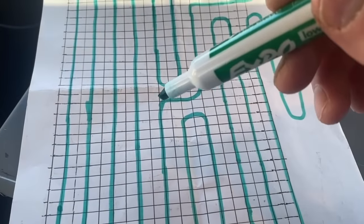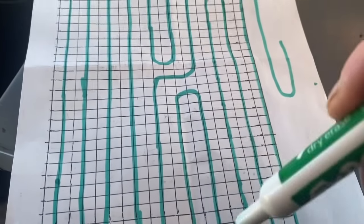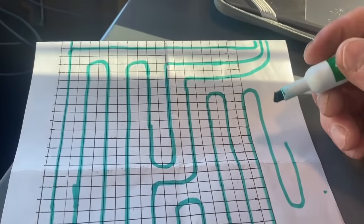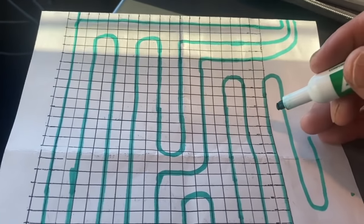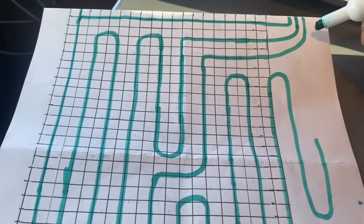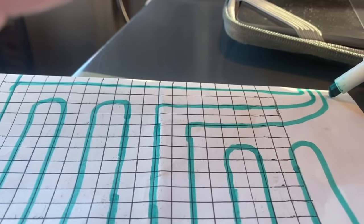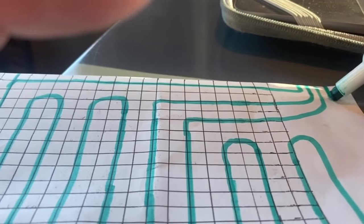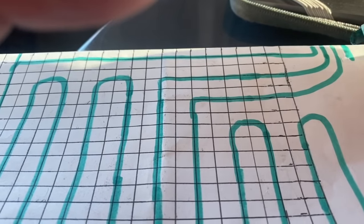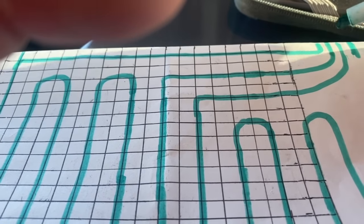We returned, we made up this little section we were short, we made that up, we got back on track, we just kept running until I was looking at my tube and I'm saying, you know what, we're almost at 200 feet, so I'm going to cut it at 200 feet, and I'm going to stuff the opposite end of the tubing back up into my electrical conduit sweeps where my header is going to be. I got electrical conduit sweeps here that go up out of the concrete.